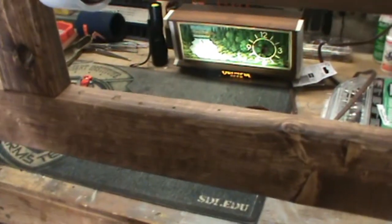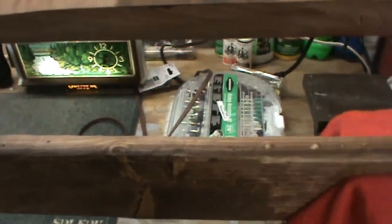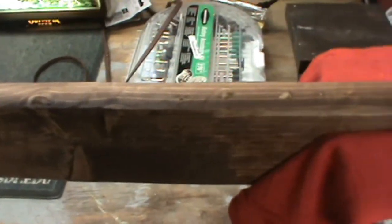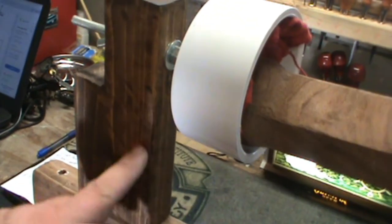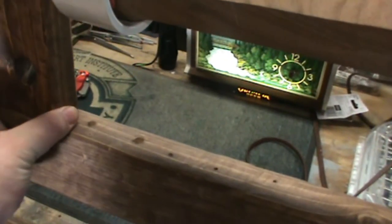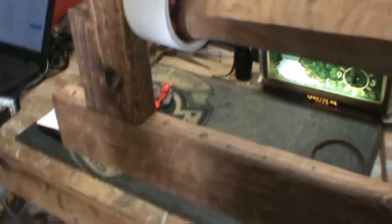I'm going to add some links to Larry Potterfield — you can find him on MidwayUSA, how to checker a stock, and he shows you his cradle. Also another guy named Mark Novak over at CN Arsenal on their YouTube channel — he uses a checkering cradle with a piece of 90-degree angle iron with a hole in it and another hole where his adjustable rod goes through. Instead of having two, it's just the one — he cinches it down tight. That's another way to do it, makes it a little easier than going with the dowel rod, but I used the rod like they said because it keeps it from moving if your bolt wants to come loose.